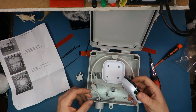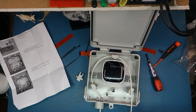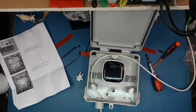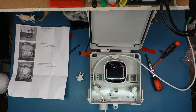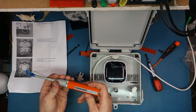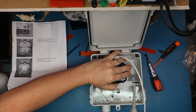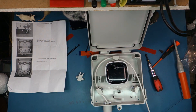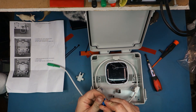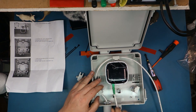So we've got our U-Fiber in place. Our port goes downward, and I'm going to put this in here. Good practice — because you guys should be learning this — is to go get my clicker. Before I put these connectors together, I want to make sure to clean them. Then I take off my adapter and pop this guy in. Always clean your connections before you put your fiber stuff together, because if you don't, you're just asking for trouble — and when your customer calls and complains, you've got nobody to blame but yourself.